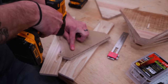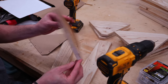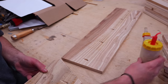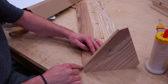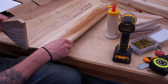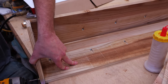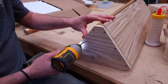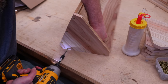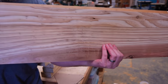For attaching the end caps I'll be using inch and a quarter deck screws. After adding some wood glue, just make sure that the edge of my sideboard matches the edge of my endboard. Install your screws, then flip it over and repeat for the other side. What I did not show here — and I learned the hard way — is that the screw placement is so close to the edge, these needed to be counterbored. The head of a deck screw tapers down, and as it gets tighter it pushes the wood out more. I actually had to remake a couple of my bottom pieces because they split.